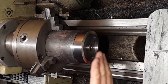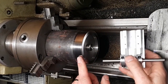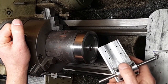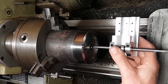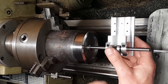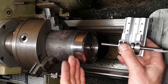This side of the flywheel is complete, so we'll take that out of the lathe, chop this off on the saw, and then flip it round and machine the other side. But first, before I take it out — because this is all now running true — I'm going to bore the hole here for it to go onto the crankshaft. I'm not going to use a reamer for this; I've had too many issues with the reamer not running true through the hole, so I'm going to bore the hole instead and that will be an exact match. There's nothing worse than seeing flywheels on an engine running crooked — when you start the engine up that's the first thing people look at — so I always want them to run true.